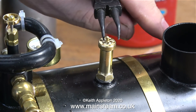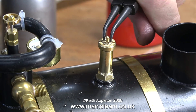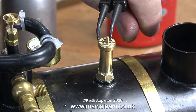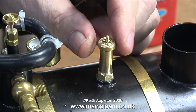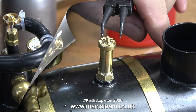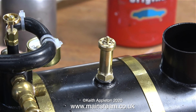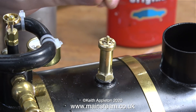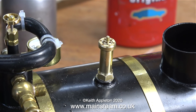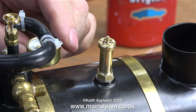This clip shows why it's essential to have an outer locking ring. As the safety valve initially blows off and makes this strange noise, the vibration causes the centre part to move about. I'll show the first clip one more time — this is before I tightened the outer ring, and that's why safety valves like this have an outer locking mechanism. On a compressed air test like this the valve will make that funny noise, but when the boiler is in steam the safety valve should pop and then just make a hissing noise as the steam escapes.